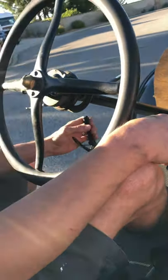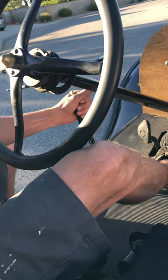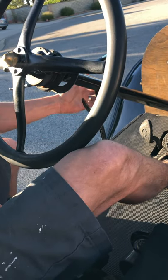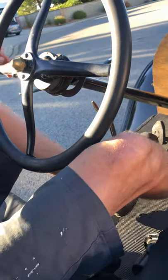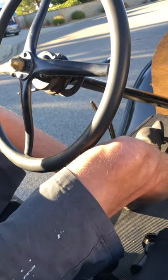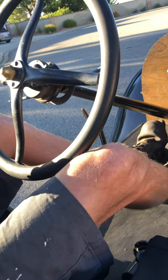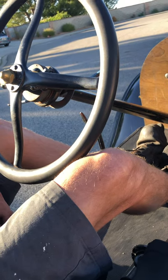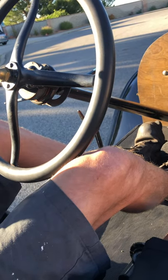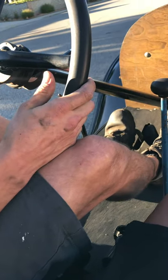This is a three-stage. All the way back is neutral and in park. I'm going to put my foot on the brake just so we don't roll back. Release it to middle — now it takes it out of parking brake, it's kind of like a neutral. But now if you push on your clutch, because your clutch is also a three-stage, your clutch is right in the middle. If you push down on the clutch, you'll feel pretty stiff — that is actually engaging low gear. So now just release the clutch, it'll start in low gear, and you can only access low gear with this in the middle.